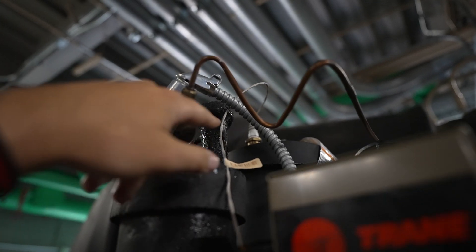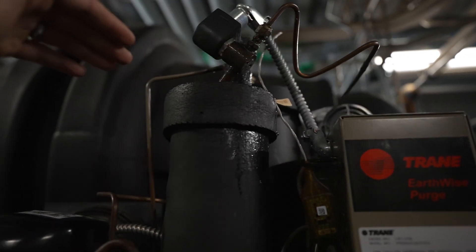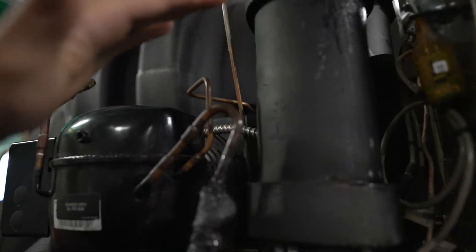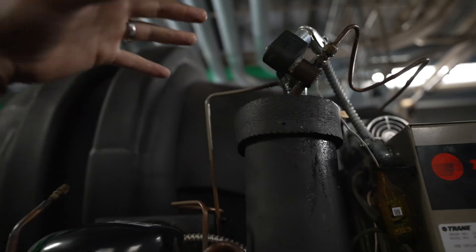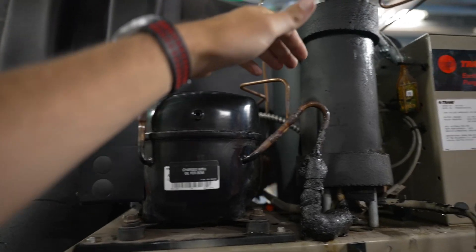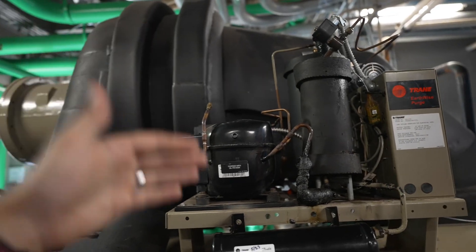Ice up here on the metering valve doesn't bother me as long as we're in a regular pump out condition — like we just kicked into pump out with the fan spinning and I know there's a lot of atmosphere to deal with. But what bothered me was having a 70-degree suction with a block of ice up there, as though we were going into a heavy pump out. Something wasn't right. These machines aren't meant to be serviced like regular equipment — you troubleshoot based on temperatures and conditions, and you only use the pressure tap when it's time to service the machine.